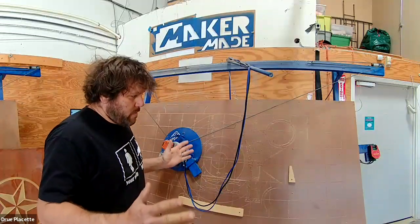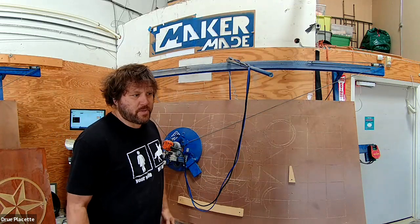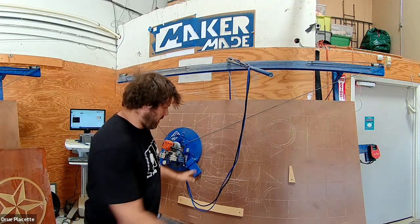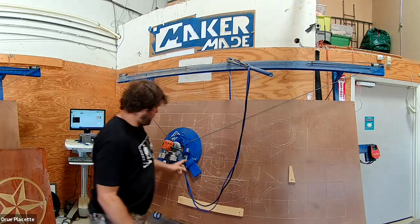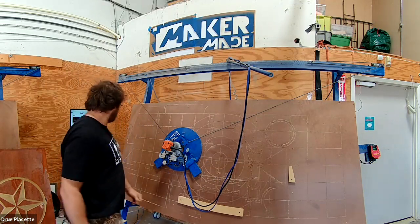Like how do you get your work material positioned exactly where it needs to be on your wasteboard? So there's things you can do. The one thing we always do is square it. You want to make sure your frame's squared and everything else, otherwise it can be tilted. But a lot of times, if we know the size, like this one we put in here, you can set a 0 point. You can set where your project starts in Easel.